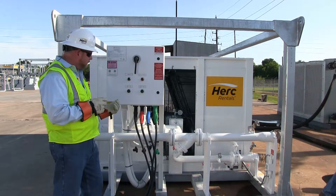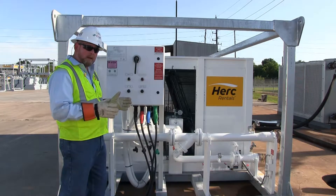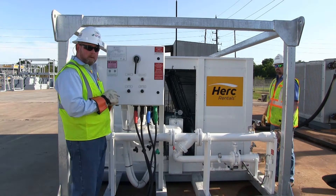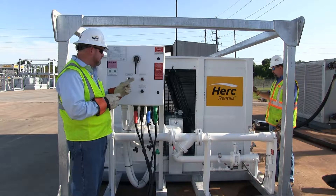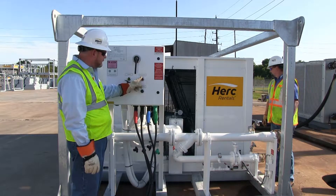So we're going to lock and tag out the main power feed source. We're going to reverse two of the camlocks to get the phase correct. Please note, never change the camlock power or phasing with the cables energized. We've reversed two of the phases now, we're going to energize the main power. Now our power light is on and our phase incorrect light is off.